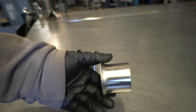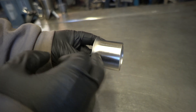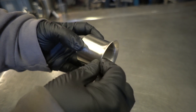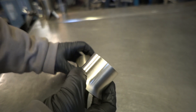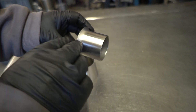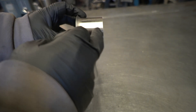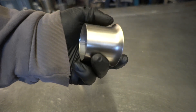The swage-style reducer is for when you're actually trying to do, like maybe you're making a downpipe or something and you're really tight on space. The actual reducing part is only less than an inch. We leave them long in case that's how you want them — they're about the same length as the concentric. But you can cut this reducer all the way back, making it so you can have a bend come right up against the back of a turbo, right up against a flange in a really tight area. These work super well to cut back and get into a tight space.